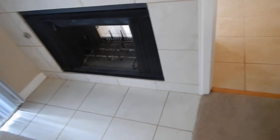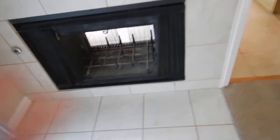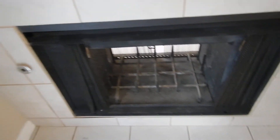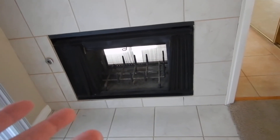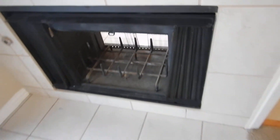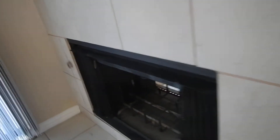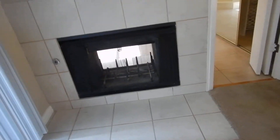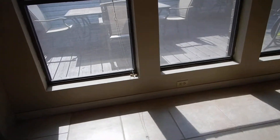This is the interior plumbing and appliance video — two birds of one stone. This is the parent bedroom suite. This is the pass-through fireplace. Neither one of the fireplaces has glass fronts; they'll have spark arresters. This one has a gas tube, the other one has gas logs. This one doesn't have a key; the other one does have a key that works on either one. The two openings into the firewall should have been sealed. Also, manufacturer specifications supersede code — this is a manufactured fireplace. Both fireplaces draw their combustion air from the living space.